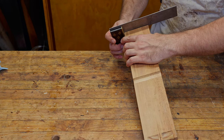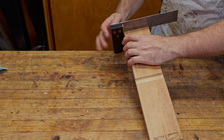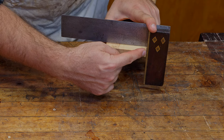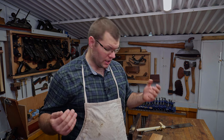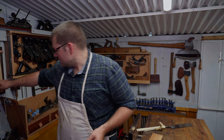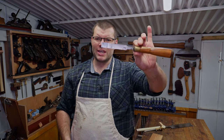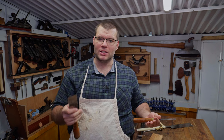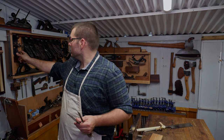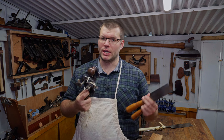Now you want to put your square onto here off your reference edge and see where there's material that's not square. In the case of this one, this side over here is a little high, so we're going to remove a little bit of material off this side, referencing from this edge which looks to be square. I'm going to secure this back on the bench with the holdfast again and we're going to use a little bit of chisel work. If you have a nice wide chisel, that's going to be easier for this process — that wider reference is going to allow it to be flatter, quicker and easier. Or you can use specialty tools such as a router plane to help level that out.